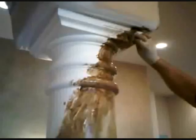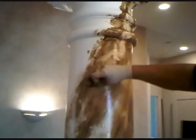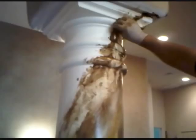When this is done and completed this step, we will check it for completeness, of course, and then we'll bag off and shoot a clear coat of clear shellac on the entire surface, nice and even, probably two coats, and we reduce that shellac by 50% or 1-to-1, however you want to say that. For a quarter of a cup of clear shellac, we add a quarter cup of denatured alcohol to thin it. It's a very thin mixture, and that's what you want, a thin glass coating on top of this. You don't want a thick varnished coat on top of this.